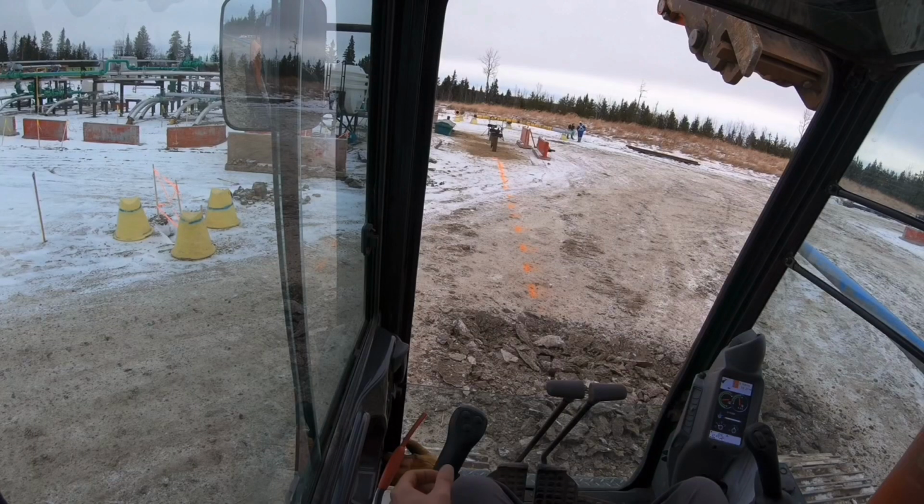Okay, so today we're going to dig a riser in, a 12-inch riser. It's 2.3 meters deep and 45 degree. So how I know how wide to go is, all I do is I double that depth, 2.3 or feet, whatever it is, double it, so 4.6, plus how wide your ditch bottom is going to be. So I'll say about 1.4, so that gives me 6 meters and that gives you a perfect one-to-one slope.